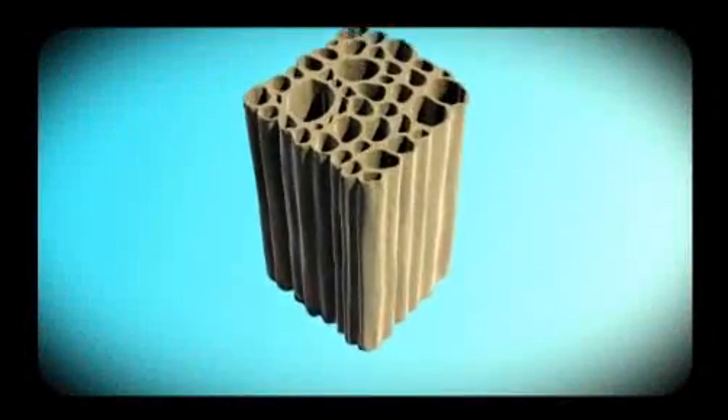The outer wall of a cellulose particle is smooth, making it difficult for the particles to join. So during the refining process, tiny cell parts — or fiber in the pulp — must become abrasive in order to form bonds tight enough for making paper. Fiber is like a string: you take that string and make it hairy, and when it gets hairy, that makes it bond together again.